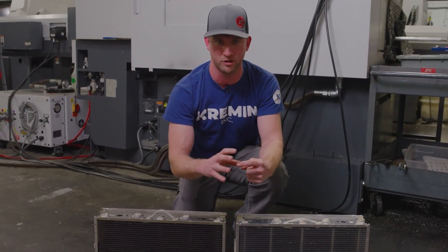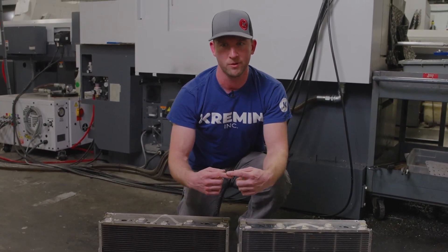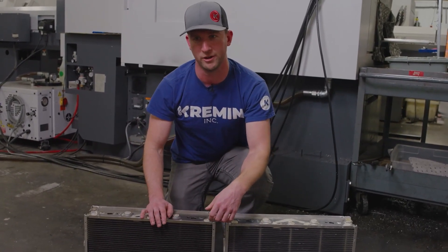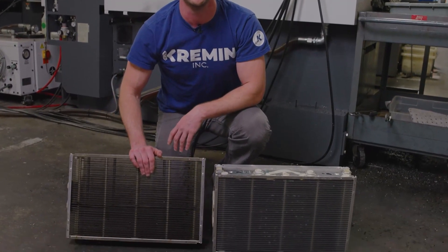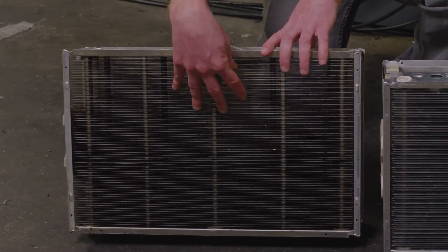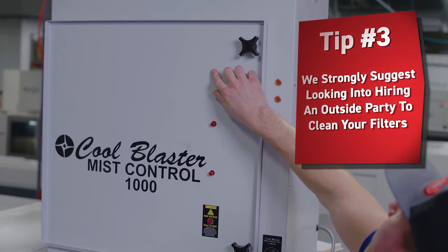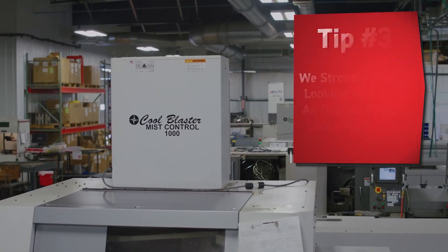So you've got a connection established, burned off — connection established, burned off. At some point they're going to grow together to the point where it's no longer going to be able to burn off any pieces, and then you're going to get a light shut off completely. This unit on my right would be a good example of one that's trending in that direction — this would need to be pulled out, sent out, and cleaned. You should be able to see the dirt and grime that's starting to build on it. Frankly, the cleaning is atrocious, difficult, and time-consuming. It's not something you're going to want to try on your own unless you're going to dedicate resources to that job. Most of the time it's more beneficial to find an outside service that will clean them for you.